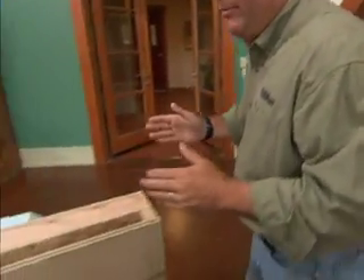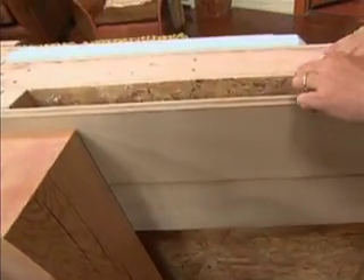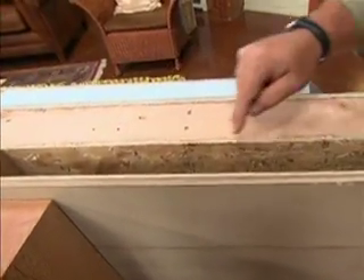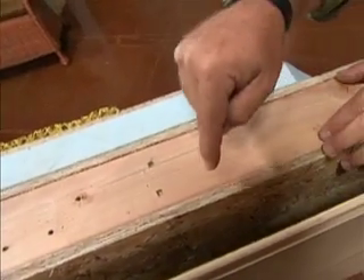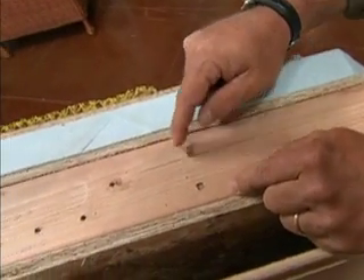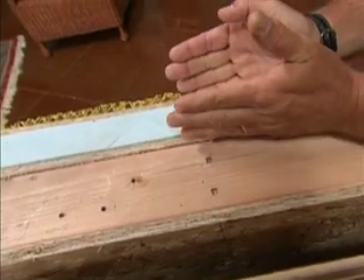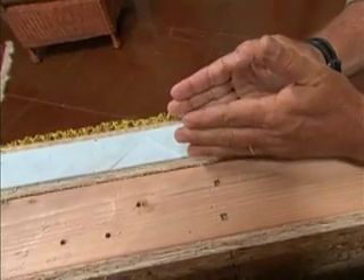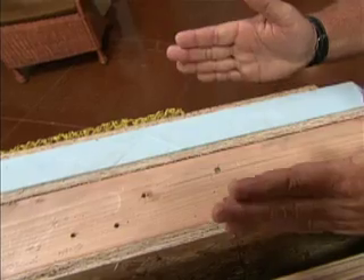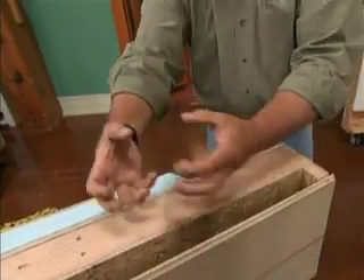This year, we're building new, and it allows us to really rethink our outside wall cavities. Here's our finished wall on the inside, and you can see this chase right here. This allows us to run pipes and wires inside that wall without penetrating the insulation and letting heat leak outside. Inside this 2x4 is urethane foam insulation that has a high R-value, and then outboard of that we have an additional 2 inches of rigid insulation. The combined R-value is about double a conventional wall, meaning about half the amount of heat passes to outside — less lost, less has to be made.